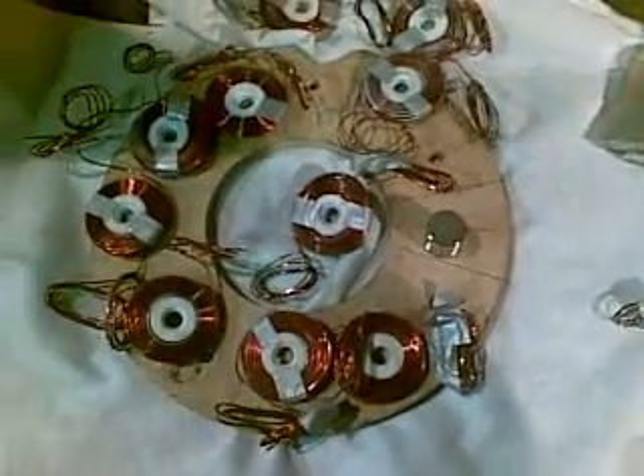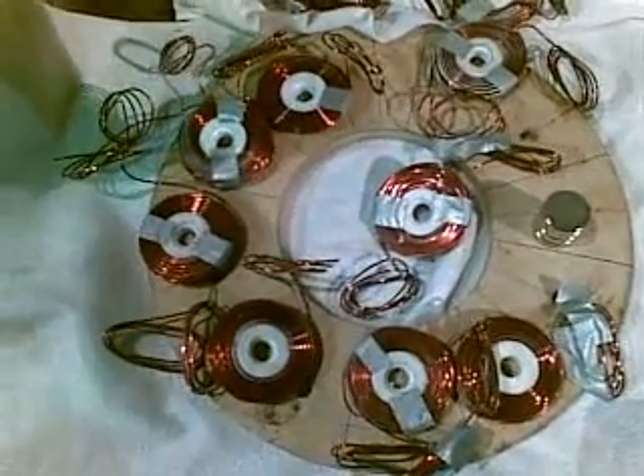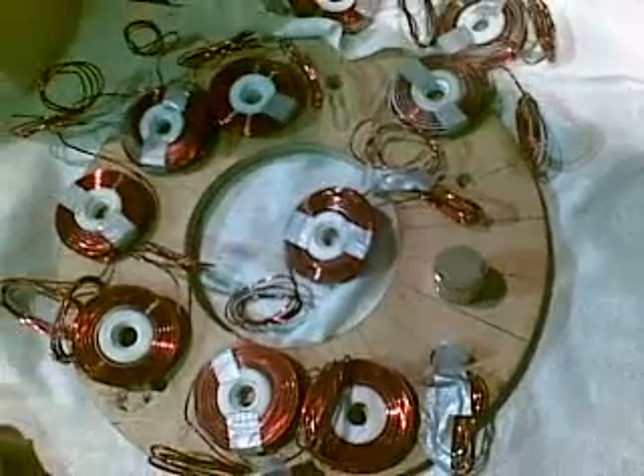Here's a little look at my stator, which I'll be using in a 3-phase wide delta configuration. I'm going to be using 16 magnets with 12 coils. I've got round magnets, so obviously I'm using round coils. For rectangular magnets, obviously you're going to use these type of coils. You would use a star configuration with 12 magnets and 9 coils for lower wind speed areas. I've got to clean this up a little bit, ready to be cast in resin. The size of the magnets you use must be in proportion to your coil size, which must be in proportion to your stator and alternator size. All that information you can find on the links shown on your screen.